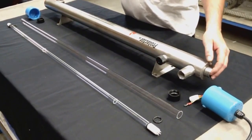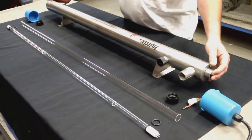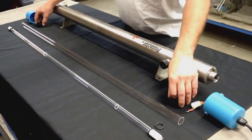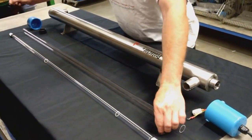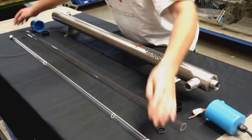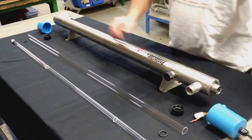Now you want to change a sleeve and a UV. This is a UV-1500. There is a sleeve, two compression nuts, two O-rings to fit the sleeve, a UV lamp, an end cap, and the ballast.